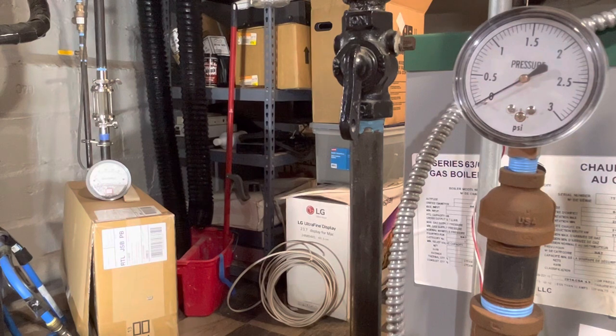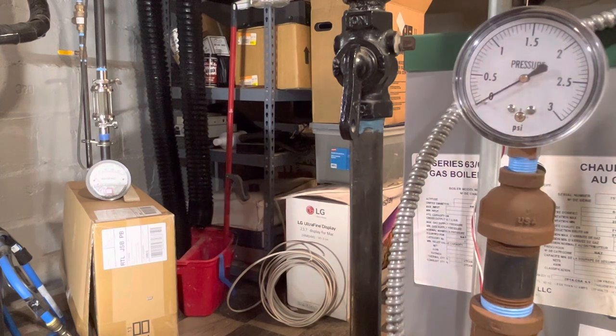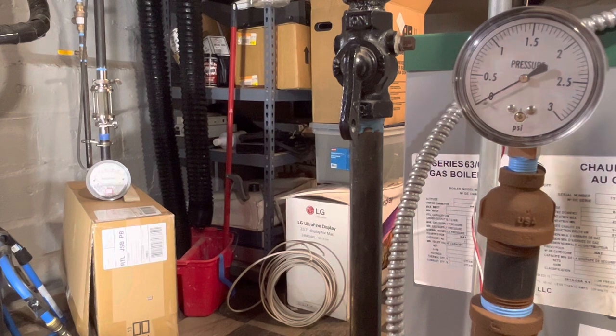This is the phase of the cycle where the main vent is venting. So we're not going to see any kind of pressure build up during this part. I only have a single Gorton number one main vent, and my main is, I don't know, something like 30 to 40 feet long, and halfway through it changes from a 2-inch main to an inch and a half. So it's not a very large main. Strictly speaking, I'll have two number one vents up there. It works pretty well with just a single number one.